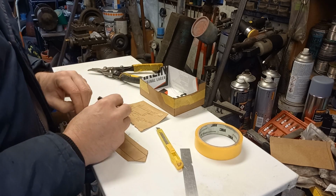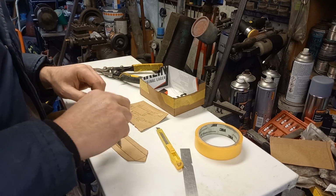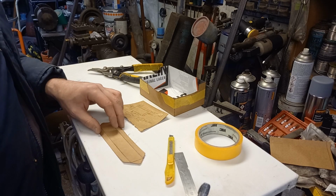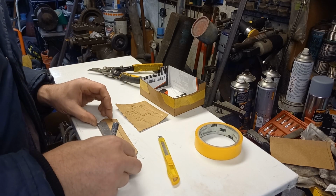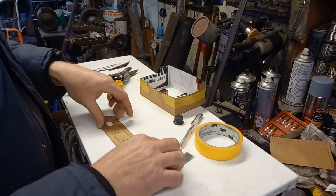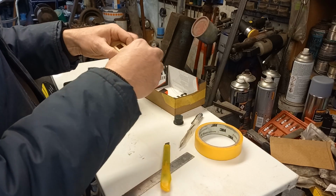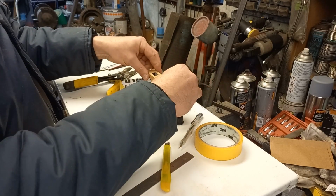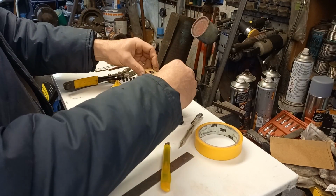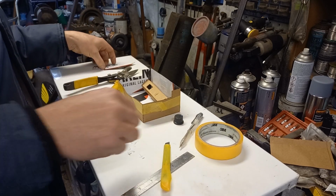Okay, so for the little display we need 22 by 14, for the switch we need a 19 by 12, and for the speed we need a 6mm hole. So let's see how this is going to look the nicest. Super! Right, that will then eventually look like that. Happy days! Right, now we can transfer it over onto the metal.